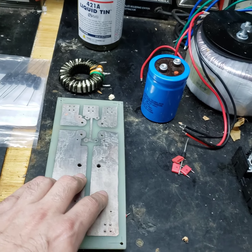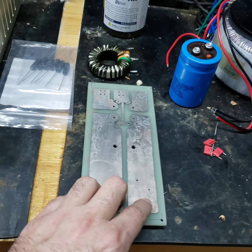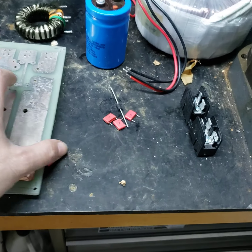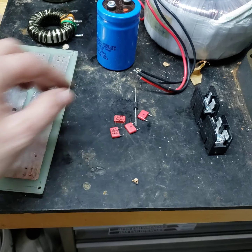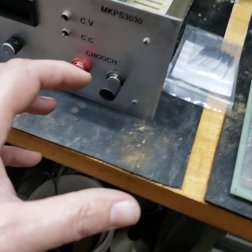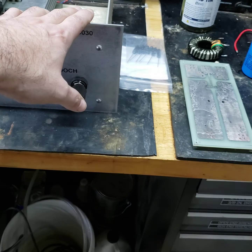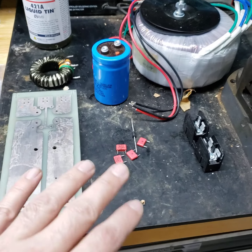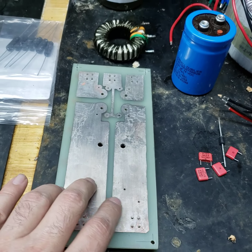The power side is going to help reduce the disturbance to the pass regulator. We just want to make sure we have a low impedance DC and AC path to the load — of course it'll only be DC, but we're going to short out all the nasty AC with some filter elements. These are probably too small, but we're going to test it. We'll make a current transformer and back-feed noise into the supply to see if we have good enough immunity. If not, we'll modify this — it's just a first pass.